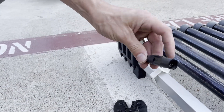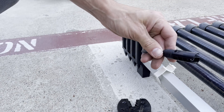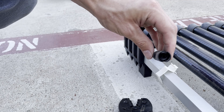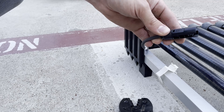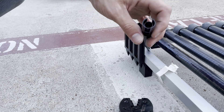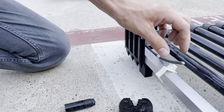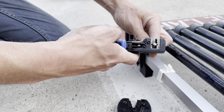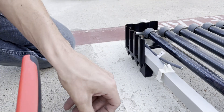Do not trust that just because this is a male connector — the actual metal piece — that means it's negative, because that's not always the case with Tyco connectors. MC4s should always be the case, but again, grabbing your multimeter and checking it doesn't hurt.